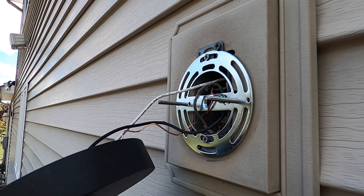I always do the neutral next. Again, it's a solid-to-stranded connection, so you don't want to be even — you want the stranded conductor a little bit past. You can feel it. Keep your finger on the solid, keep your finger on the stranded, and as I'm putting the wire nut on I can feel that nothing's moving. Sometimes if you put them even with each other, you can feel the stranded wire push back; going a little past guarantees really good connections. Use the correct wire nut size. It pays to buy a good Ideal wire nut or Buchanan wire nut and keep a few of each size in your parts box — a lot of times the wire nuts that come with the fixtures are junk.